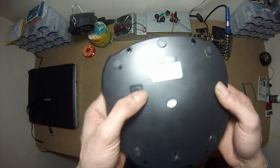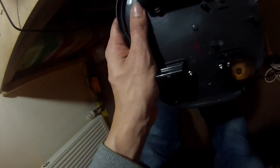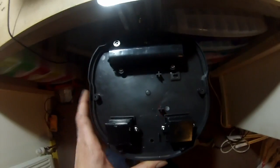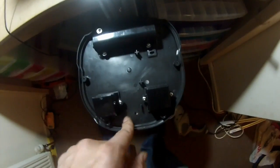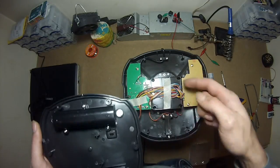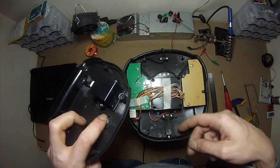And then just put this base onto, I'll show you. Just put the base on exactly where you want it, and then drill through straight and mark the holes. Once you've marked the holes, you can drill straight through. Before you flip it around and screw back on, put the bolts back on these so the screw doesn't drop back inside there.